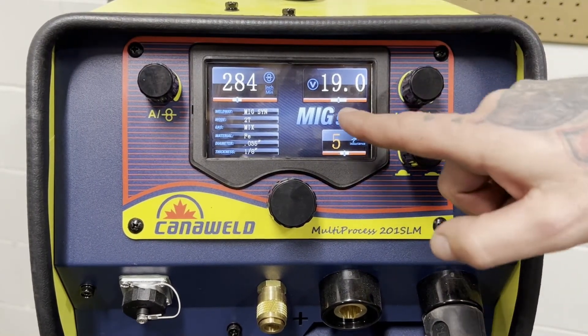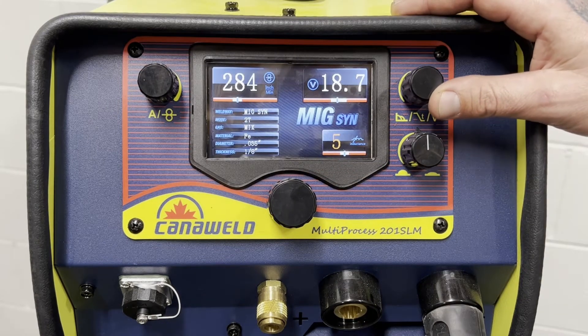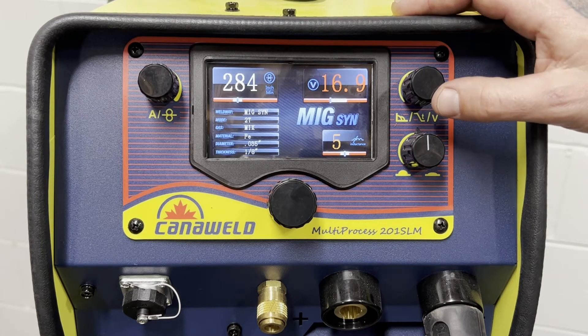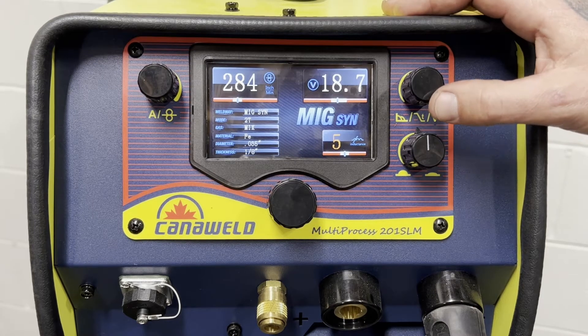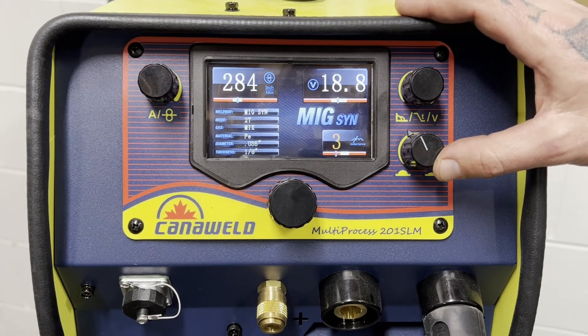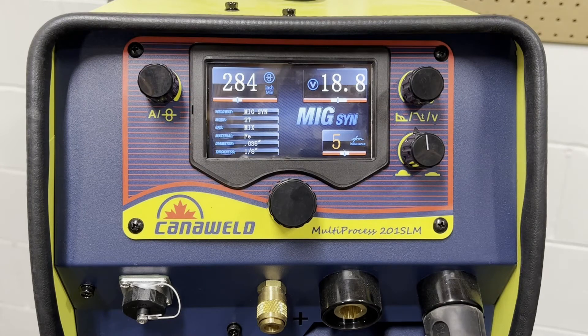You might notice that little blue bar in the center of the display. Like I mentioned before, everybody welds a little bit different, so you have a window of plus or minus what the machine suggests. Watch what happens when you get outside what it suggests — your numbers turn red. That means the machine is telling you you've gone too far. But it is nice to have this little bit of window to play with, because some of us weld a little faster and some of us weld a little slower. We also have our inductance we can play with here, but I'm going to keep it right in the middle. And if you've forgotten anything, you have a quick rundown of all the parameters you've selected.